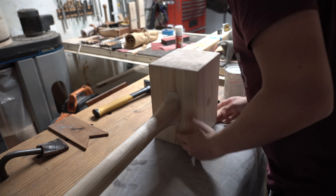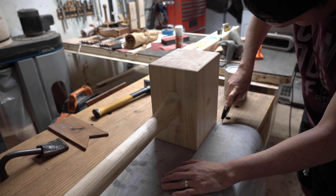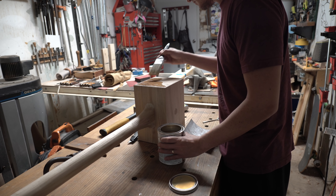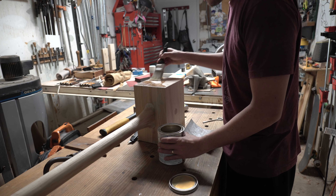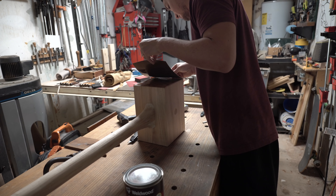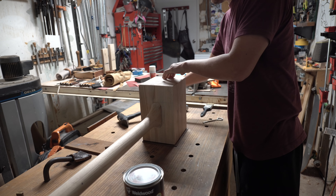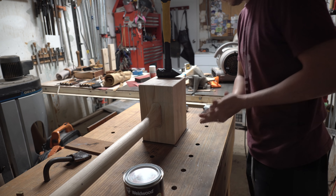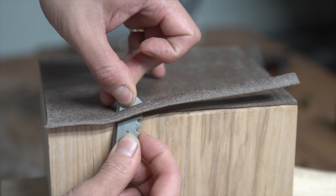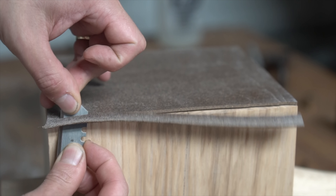The purpose of this mallet is to knock large joint beams together and I'm anticipating that to be mostly softer construction grade wood. Since ash is pretty hard, a marring preventative is in order — I'm going with cork rubber, also known as crubber, for one face and I'll apply that with some basic contact adhesive. This stuff is widely available, cheap, and pretty easy to apply. I use it to attach leather to my workbench vices and that's actually the same exact can from over a year ago. Cutting the crubber off is definitely something I was not good at — even using the workpiece as a guide I couldn't seem to cut it straight — but ultimately it's fine, and when it eventually wears out I'll just remove and replace it.